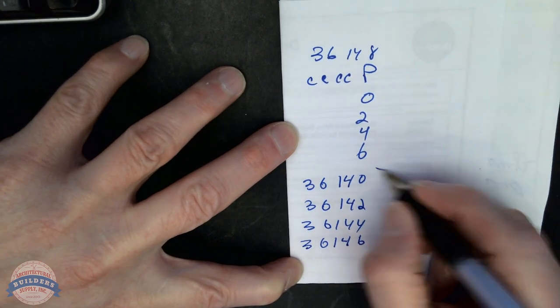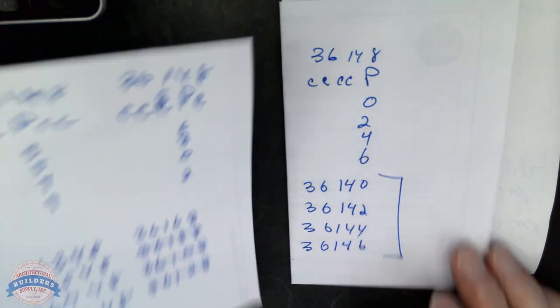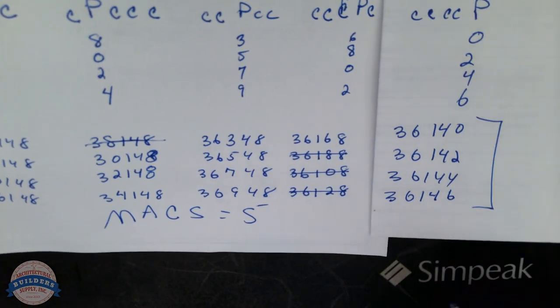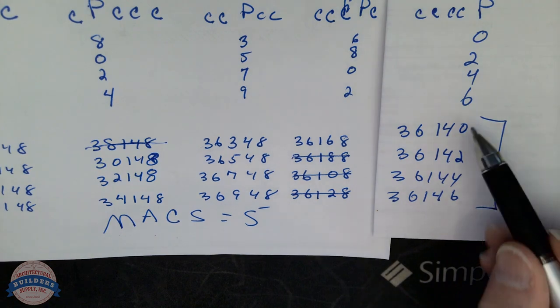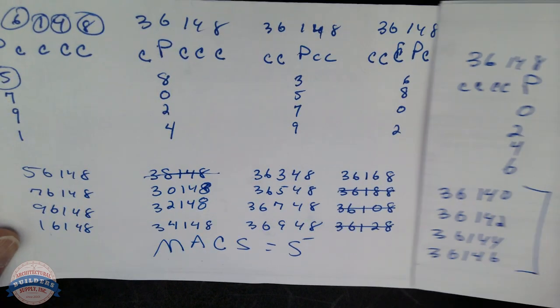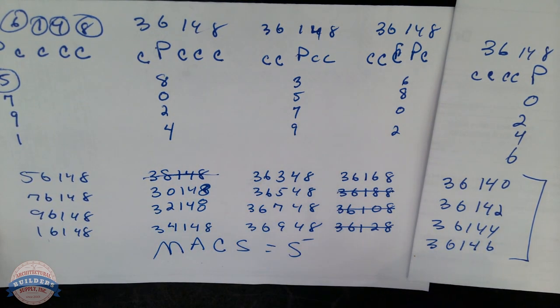That's okay. So now I've got back to 16. I've got all the changes that I will need for this job. I lost 4 because of the max violation, the maximum adjacent cut specification, but my last progression was good. So I've got 16 changes. I'm going to record all of these, and notate on there what I used when I'm cutting my keys so I know what's left over.